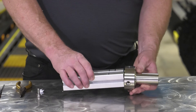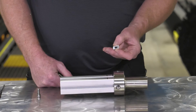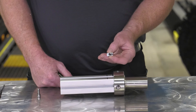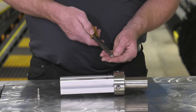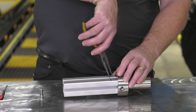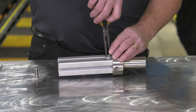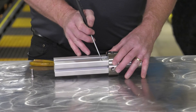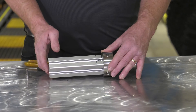To put the T-nut into position when it's in the shaft, we take needle nose pliers in order to drop the T-nut into the shaft slot. On the T-nut, we've drawn a reference line with a sharpie that we can look at with a flashlight through the bolt hole in order to know that we have it aligned correctly. Taking the needle nose pliers, we take that T-nut and insert it properly into the wheelboss shaft. We've got to make sure we do this right, so we insert it in and now we have it in position. We can use a small screwdriver to rotate that T-nut and get it turned at a 90 degree angle from the direction of the shaft.